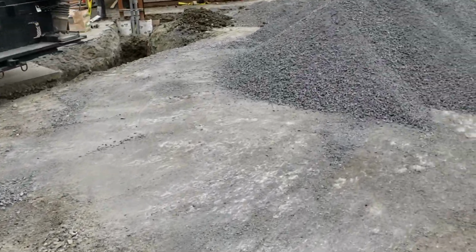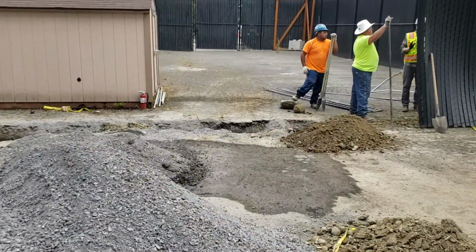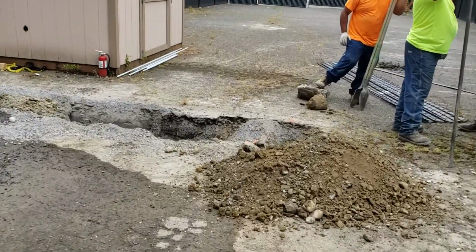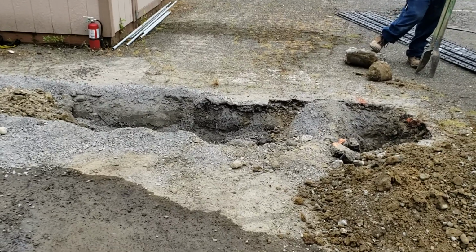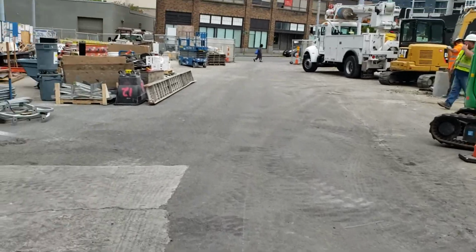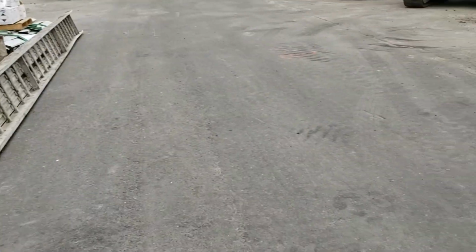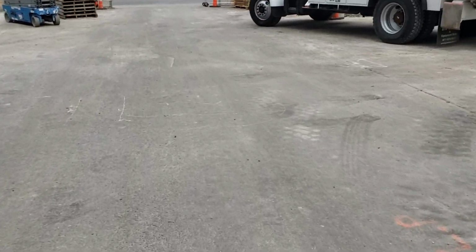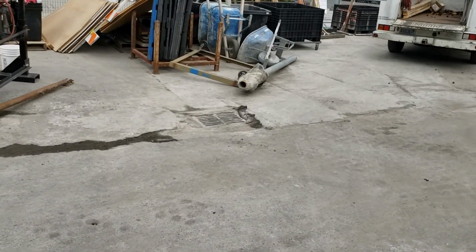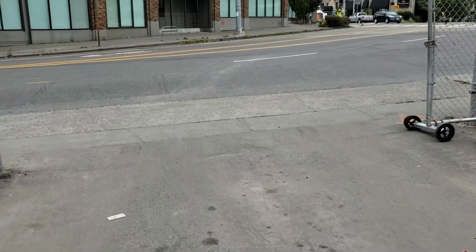Okay, so I'm walking over here. I had a quick peek inside this fence. It's all alligatored, and that's why that's all getting R&R'd. And you can see here, the actual depth is 2 inches at maximum, and it goes out from there. Okay, so I just pulled Brian over and showed him that basin, and showed him that we'd have to excavate around it to key into it, and he said, yeah, that's totally fine. And there's another basin with concrete around it. Obviously we got to come out and key in, so there will be concrete disposal. But I wanted to show you this.